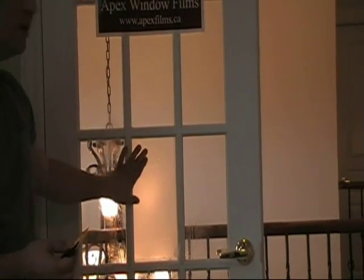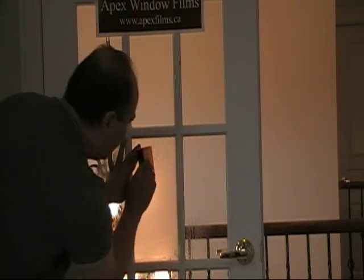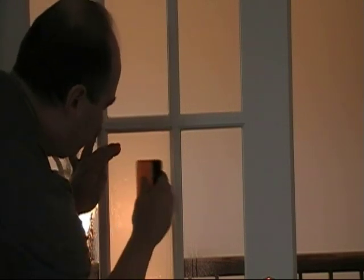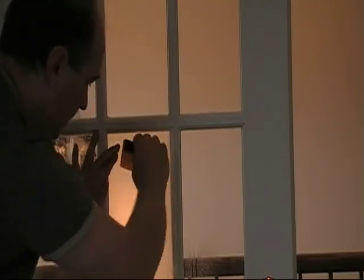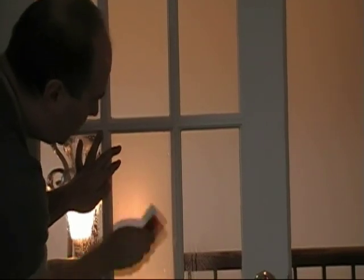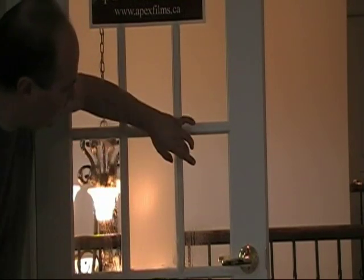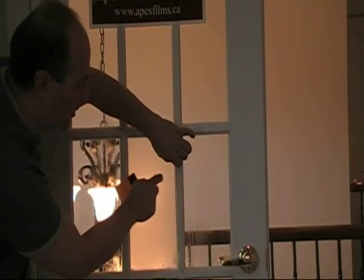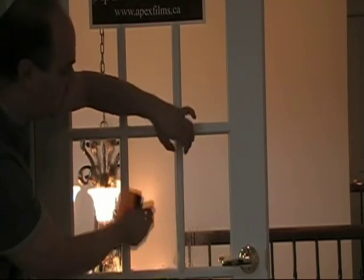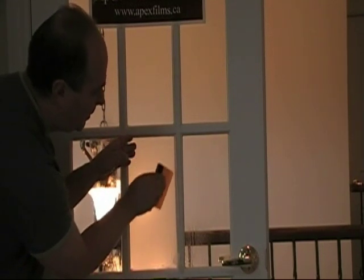All my tools are designed to work on wet film — not dry. If it's dry it'll grab and scratch the film. Starting at the top center, push the water out a little bit and work it from the sides down. Don't go right to the edge until you're ready to trim, because capillary action of the water can draw some contaminant out — a little bit of dust, maybe a paint chip. So don't push right to the edge, just leave maybe half an inch on a window like that.